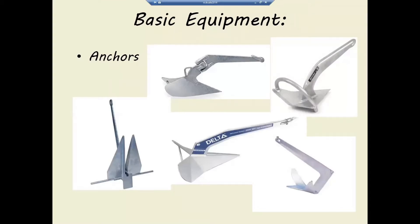Let's talk about some basic equipment. Obviously there are anchors, and at the boat show someone almost always pipes up and asks which one is the best. Generally my answer is it depends on where you're at and what you're doing. When I first started going down to the British Virgin Islands, they had CQRs on all the boats. Every time I dropped one into that light, fluffy coral sand, it would just lay on its side because of that big heavy hinge — the coral sand was too light for the nose to dig in and flip up that heavy hinge. So I'd have to put on my snorkel gear, go down and tip the anchor up manually, stick it into the sand, and then it would hold fine.